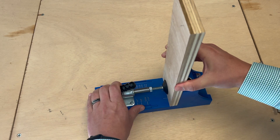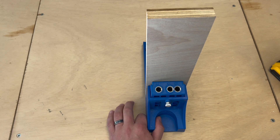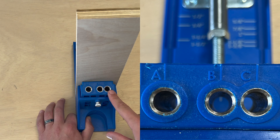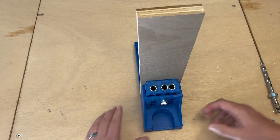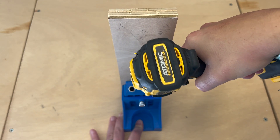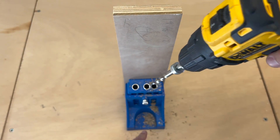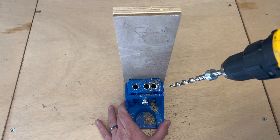We clamp the board in — that holds it in place. One thing to note: you really want two pocket holes connecting, not just one screw for your joint. The way this is set up, if you don't have enough room on the wide side, you can still do B and C. We have enough room, so we're going to do A and C — two pocket holes. Now we get our drill, put the bit in, and we are ready to go. You can see the mess it's already creating, so if you want to use that dust collection attachment, it's probably a good idea.